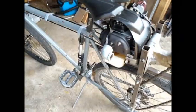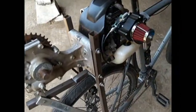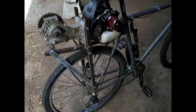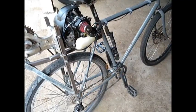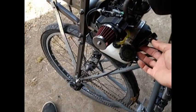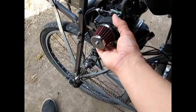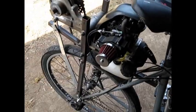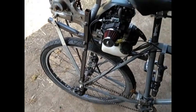I really like this setup. Something I added this morning was just a little kill switch — you hit that little button right here and that cuts power to the motor. Really simple to use. I'm just going to start it up and show you how it runs. Obviously it's a pull start, so you reach around here. I might have to put on the choke. You prime it with a couple pumps on the primer bulb, and then it just starts right up pretty easily. It's not too loud — not quiet, but not loud.